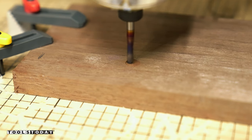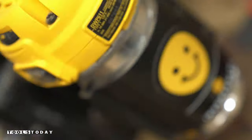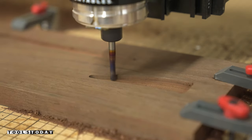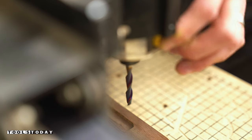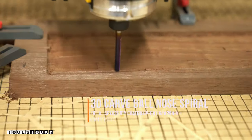Alright, and the last thing left to do is to carve a drawer front with some wavy 3D patterns on my CNC. I started with the Amana ¼ inch spiral bit and the 3D adaptive clearing toolpath to remove the bulk of the material. Then I swapped over to my Amana ¼ inch radius ball nose bit with the 3D parallel toolpath to smooth out the final shape.